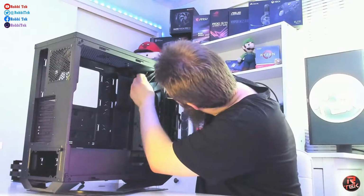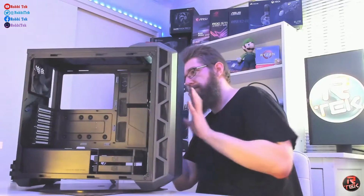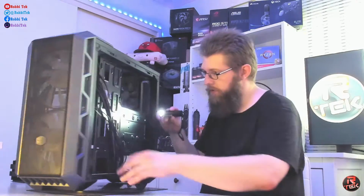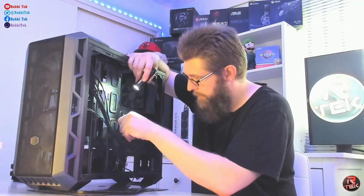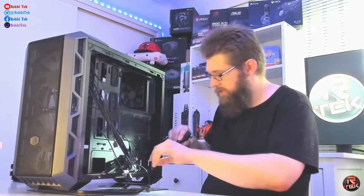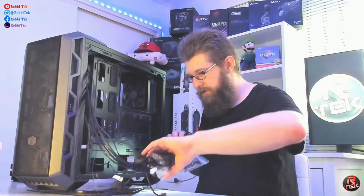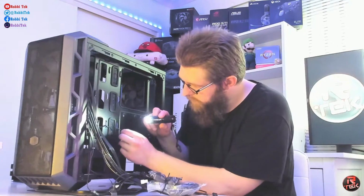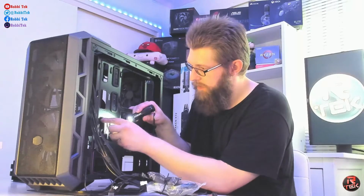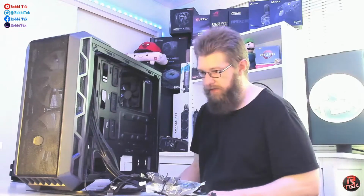Interesting, guys. So I'm just going to check the quality there. Alrighty. So I'm going to undo, just to check the quality of the cabling itself. I'm going to pull that out. I've got a dry satchel, and everything is neatly wrapped on itself to an nth degree, as you can see here. I will take this out, even though it could be potentially reused. I'll use actual cable ties, not metal cable ties that could cause a short one day in the future if overly tightened, but I will keep it aside for later on.